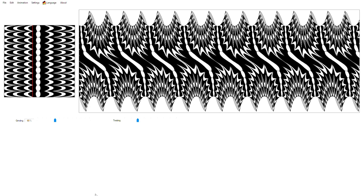Right now we're in a pattern prediction software created specifically for the bladesmith, predicting twist rates and grinding depths in different patterns of steel. It's called Thor2.exe — it's an old program but it still works great. I put JPEG or PNG images, simple vectors, into it. I can create them in Inkscape — that's my preference. Simple black and white stuff for pattern prediction. This is a Ws pattern I created in Inkscape, exported as a PNG, and brought into Thor2 for some pattern prediction.